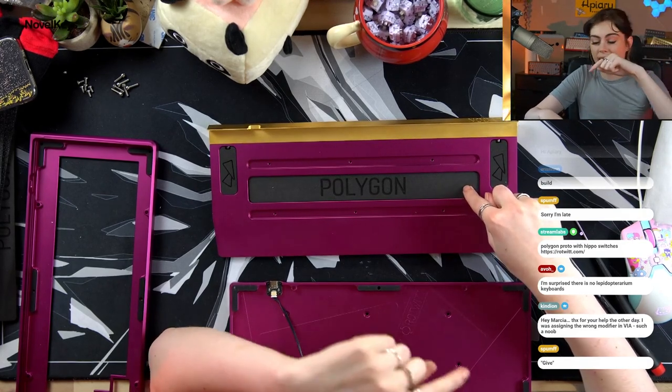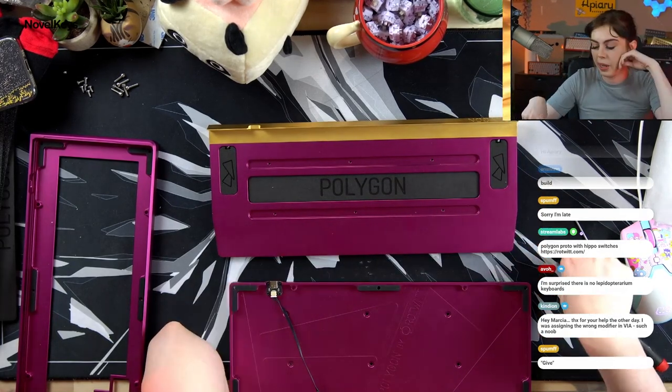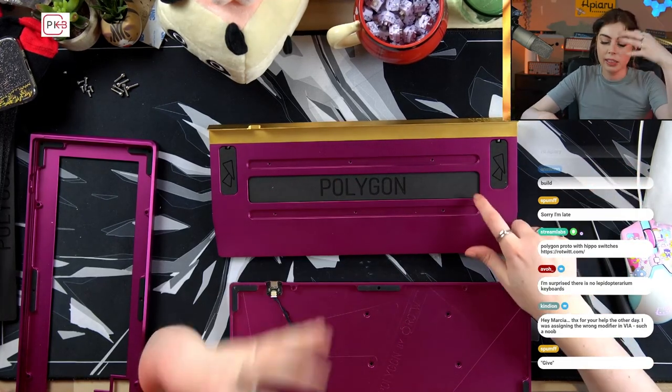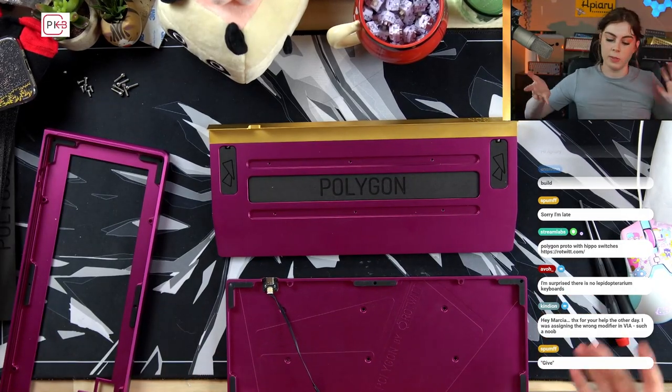There's not a lot of compression in it versus something like foam, where there is a lot of compression available to you, but it's easier to get a hold of. And then there's rubber, which is the bounciest and the least dampening and the least cushion. Right, that's just the basic rule of gaskets as far as materials go.